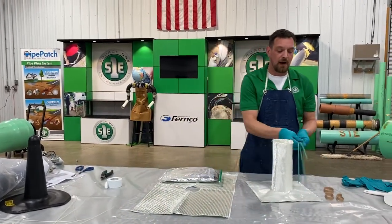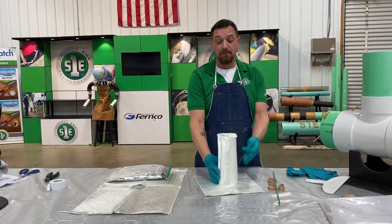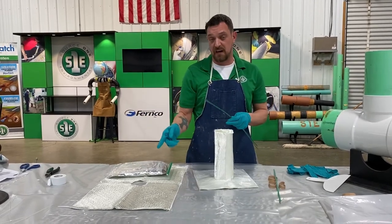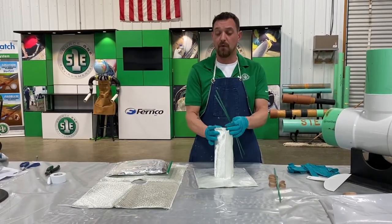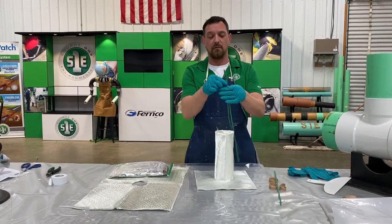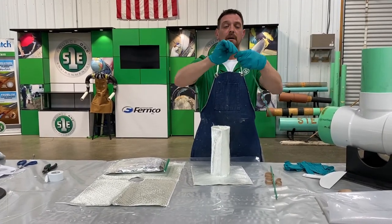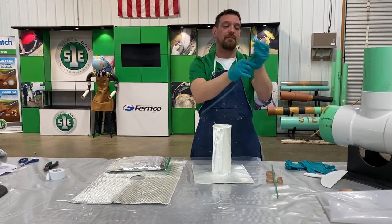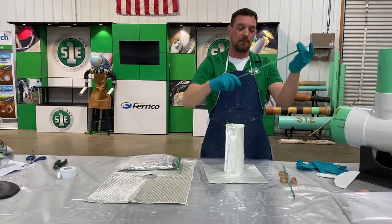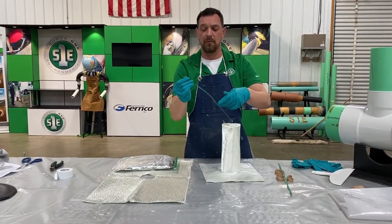And then our wire ties. That is for the 4-inch lid. The 6-inch will get the zip ties, but the 4-inch lid, or the 4-inch portion of the lateral, will get these wire ties. And what you're going to do is you're just going to stack them on top of each other. You're going to put two together, two, three, one, two, three. And now you've got one bread tie, because we want them doubled up.